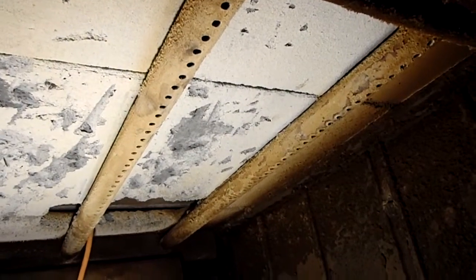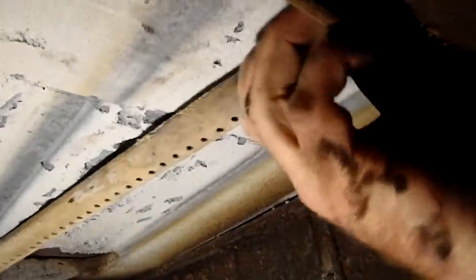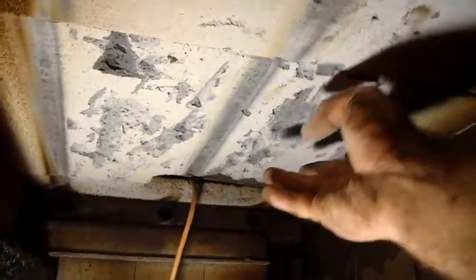And in order to do that, I want to close my stove damper. Pull this out, and there's a tube. I'll do the same thing. I'm just going to push it up and push it back to the opening, which now I can't do, of course. I'm going to have to remove, there we go. Kind of hard to work with one hand when I really need two, but I have a little extra weight on this one because of the stove damper. Just bear with me here. I do apologize. There we go. Okay, so now all three of those are out, and the sealant can actually come down now.